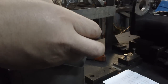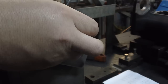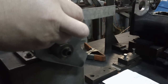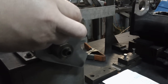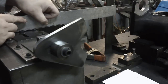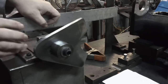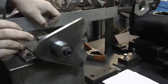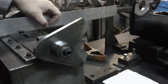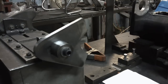This hits here. We have 7, 8, a little over 8.5, and that gives us under 1.5 inches over here. So you have to take into consideration the width of the chain coming in. With a stock sprocket, this will be too far in because of the narrower tires. So the offset sprocket that'll have to go in there will probably be 1/4 inch or 1/8 inch offset to move it over even slightly more to put that chain in the correct spot.